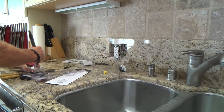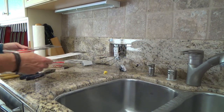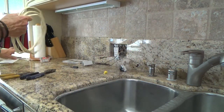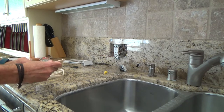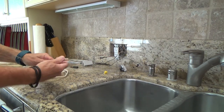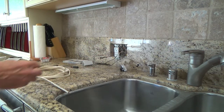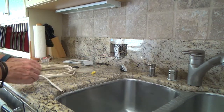If that ground wire was longer I could have done it that way. But I'm not going to use the crimping tool or the 12 gauge wire. Why not? Because this flexible wire is better. I'm just going to put another wire on and put it underneath the same wire nut — I can get three wires under this round yellow wire nut. If I use 12 gauge it might be too tight and I'd need a red wire nut, which is bigger, and then I'd have to cram it all into the box.